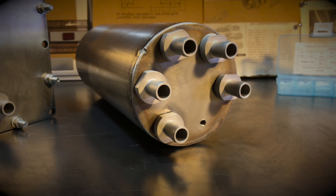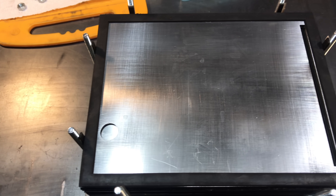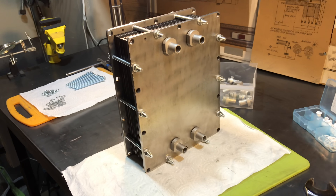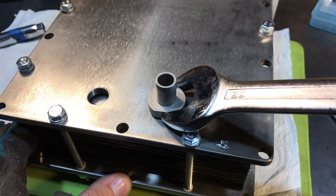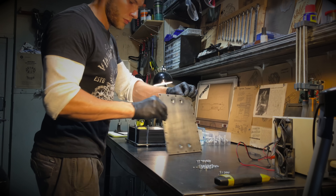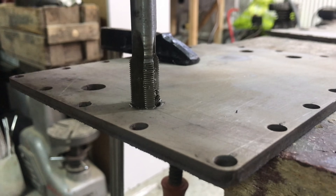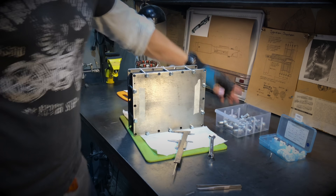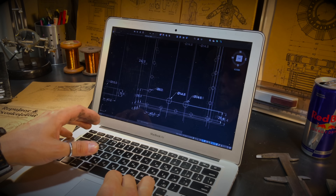In this model, all fittings are made from 304 stainless steel instead of brass. Spacers and insulating washers are made to order from fluoroplastic. The core area was recalculated more accurately. I changed the configuration of the circulation holes for less gas filling, so now both the reactor and the circulation tank are absolutely resistant to acid, alkali, and even local tap water — and this model is no longer a shame to put into mass production. PDF blueprints and laser-cutting files are already available and actively downloaded by engineers of AlexLab.